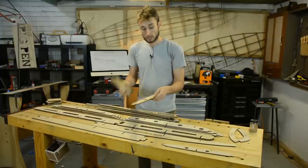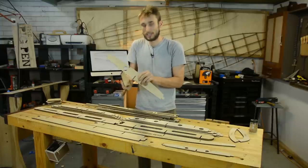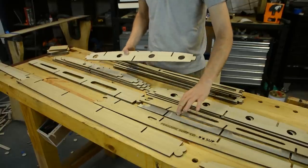If you find that the fit is loose, just apply a little bit of water to that area on both sides and that will make those fibers swell up and the fit should be nice again. Don't forget that we have to check both the center and both the sides with both outer spines.